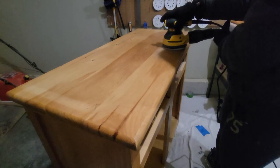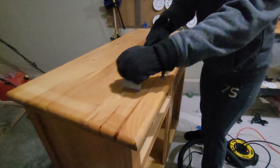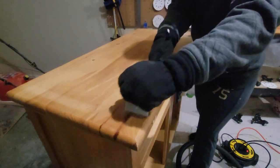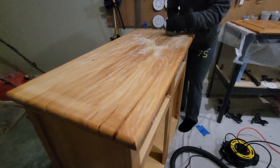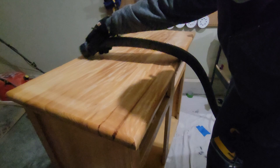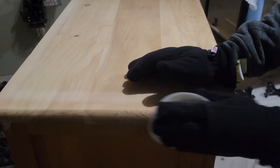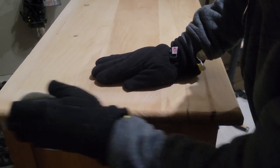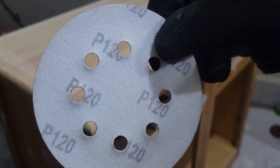While the Bondo dries I'm just taking 80 grit sandpaper to get off the finish on the top. I quickly realized the finish was so thick that I took my carbide scraper and tried to scrape off as much as I could and then went back again with the 80 grit. After vacuuming up all the dust I decided to grab my hot iron with a damp rag to try and swell some of the wood as there were some gouges — just trying to get the wood to swell so I can sand it and make it look nicer. I'm using the 80 grit and sanding it down by hand since I don't want to ruin the edges with the orbital sander. Then you just want to wipe off all the dust before moving on to 120 grit.